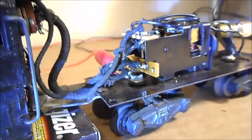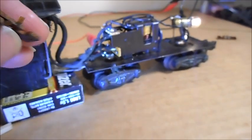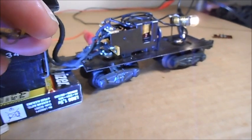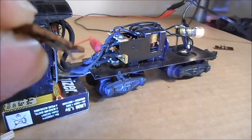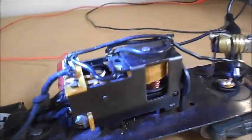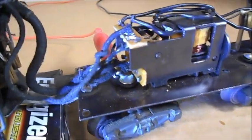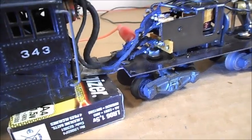And one thing that you need to do when you get these things, these fingers, they're not bent down enough from the factory. You need to bend these things down, preload them, bend them down so they're hanging down and they have more tension on that reversing unit barrel. And of course you need to clean that. You need to clean this thing down in here, the rotating drum that the fingers are touching on. All this has to be really clean. You have to inspect it, make sure that there's no pitting and that it doesn't need replaced also.